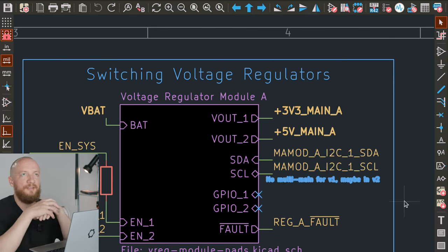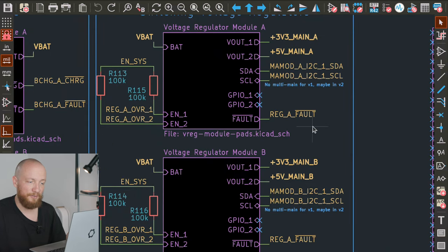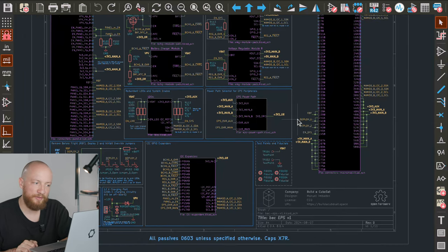I2C should be able to work with multiple microcontrollers on the same bus — I have never tried this but I've read it should be possible, and I intend to play it safe for this version. So all of this telemetry is only going to the A bus. It would be nice to have all the telemetry on both buses, but for now this will be just fine. Also worth noting: there are probably a few components missing. For example, I did not implement any filtering, mainly because I don't know enough about filtering — I only try to use components that I know the purpose of.